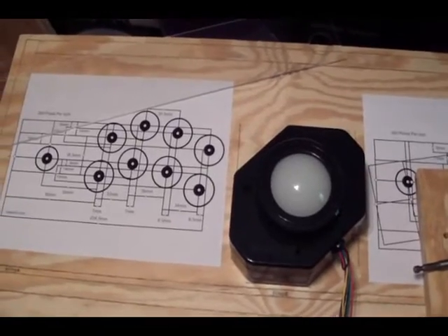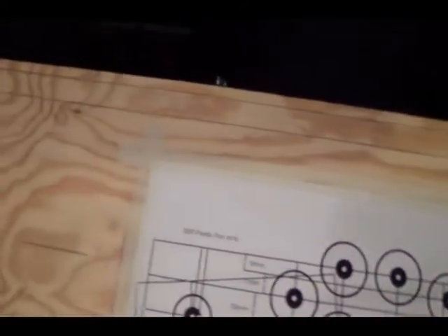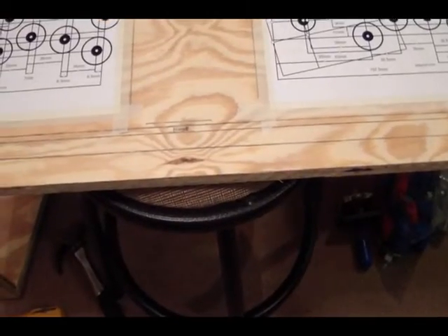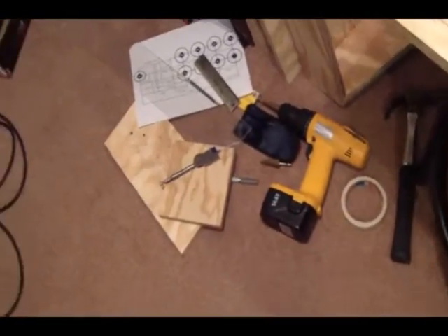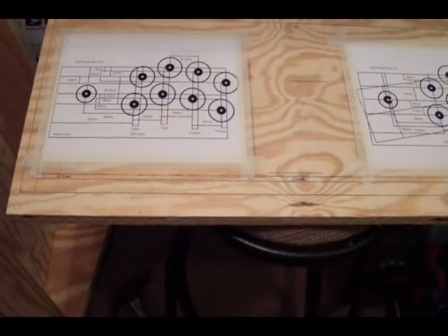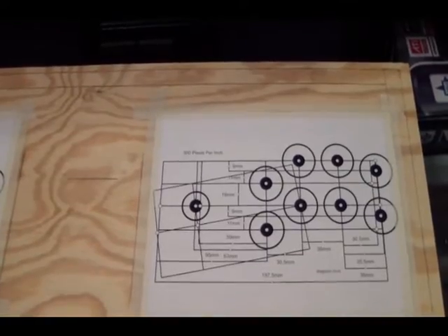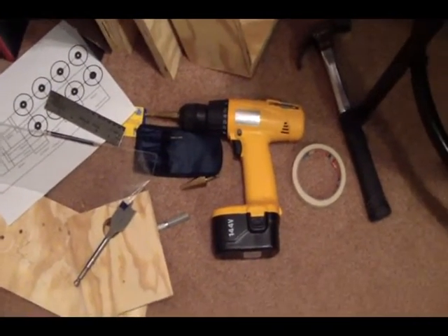Let's get these taped up, get them marked, and get ready to drill these out. We've got our templates taped in place with a little masking tape — it's not very sticky, it'll come off the wood pretty easily but will hold the templates. I'm probably going to go out on the porch to do this. It's between 60 and 70 degrees out there. It'll be a lot easier than cleaning up the mess in the office. I need to clamp this probably to the floorboards or the steps outside with some scrap wood underneath it so I don't run my paddle bit through and damage the decking.